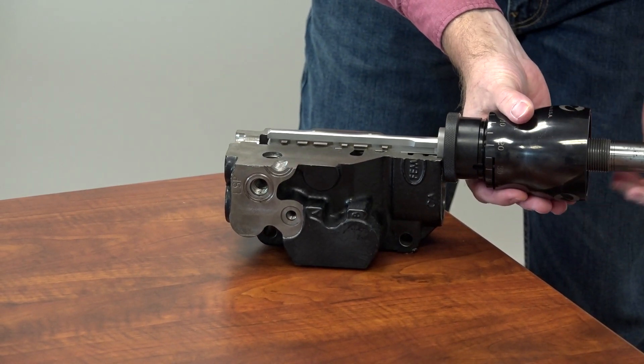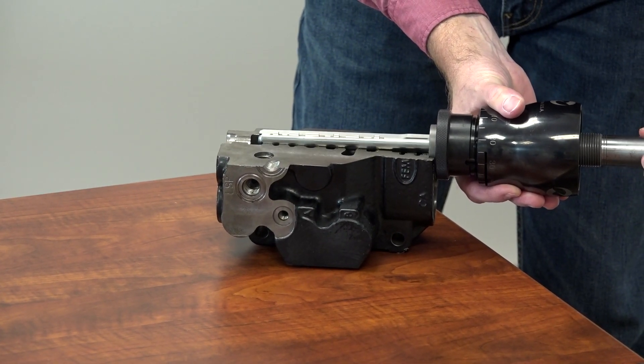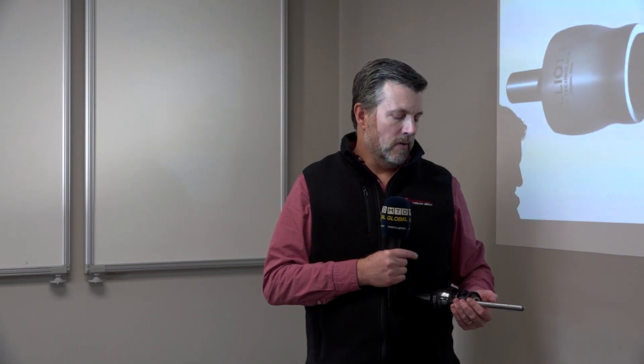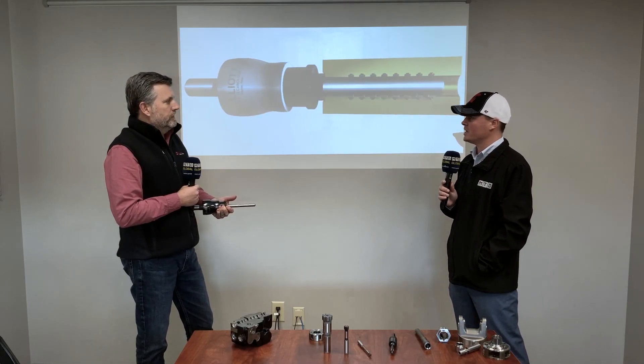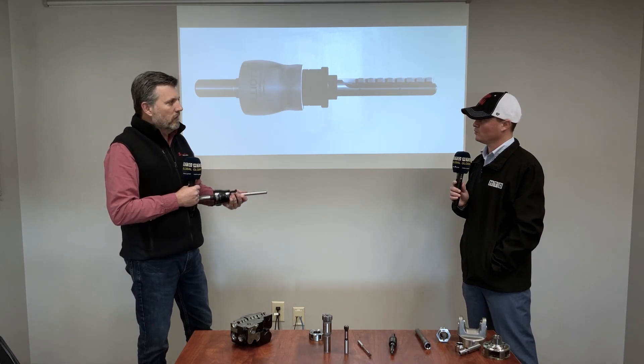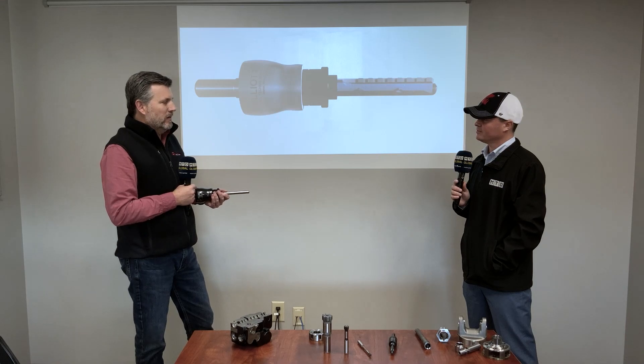For tool lifespan, what we've developed over the years is: if you run these carbide-tip blades from roughly 100 to 150 minutes of machining time, you'll be able to regrind them without any heavy chipping. You can get two or three regrinds, and our largest customer gets up to seven regrinds on a carbide-tip cutter because they've been doing it a long time. We do regrind these here in Dayton at Elliott as well. After regrinding, the tolerance still stays within the original tolerance — it's a pretty simple face grind to get a sharp edge again.